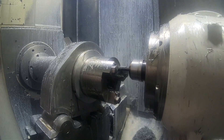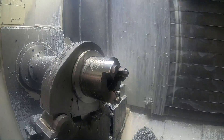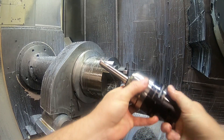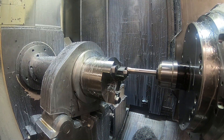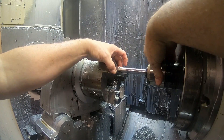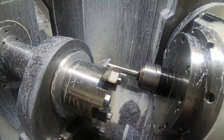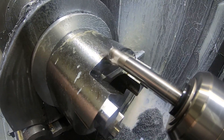The faster way, as you're going to see in a second, is a feed mill. Although in this particular program I'm running very conservative — that's a feed mill, it's a Mitsubishi feed mill, a 7/8-inch diameter with a 3/4-inch shank, and it's sticking out about 4.5 inches from the tool holder. So this is a fairly long overhang for a milling tool of this type, although I have stuck this tool out even longer. This particular clip is sped up; the rest of the clips are running at normal speed on this tool.